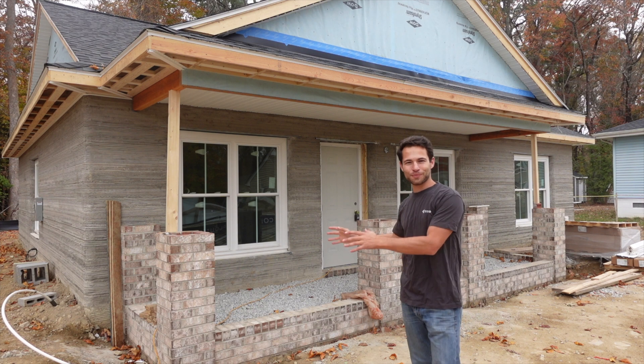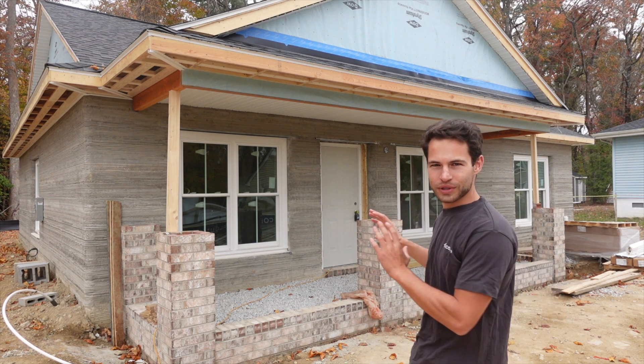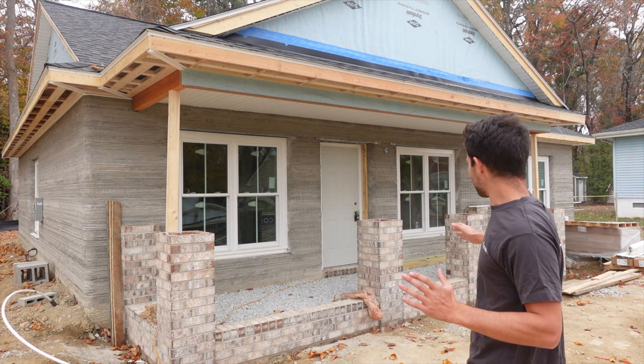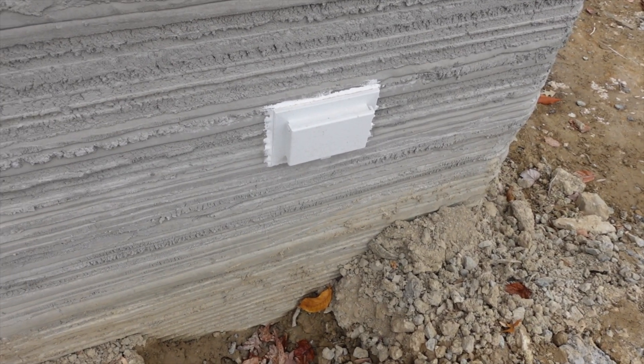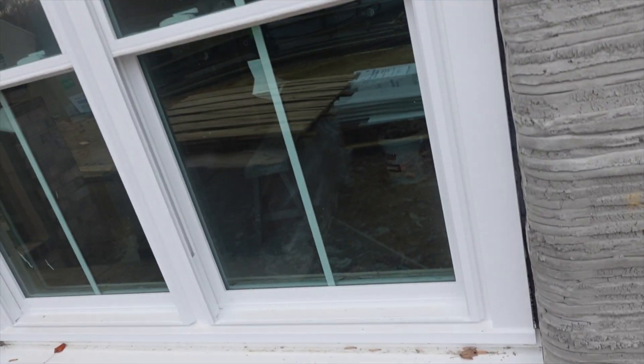Now we're looking at the front of the building. It looks so much better with all the added touches rather than just the printed walls. It's a detail you don't even notice until you inspect closer — it's going to be incredibly strong. They're doing a great job on the construction. This front patio looks fantastic. I like how they juxtapose the brick with the concrete. Having different elements coming together is much nicer than something monotonous. Here's a look at how they installed some of the utilities in the home — it looks like they used some silicone to seal around there. The concrete layers look pretty good, with a little bit of variance in layer quality, but not too much cracking. There's maybe one crack up at that lintel that probably caused some issues. They were really smart to include expansion joints below the window — that's part of why they haven't had so much cracking.